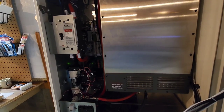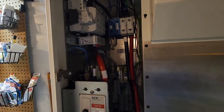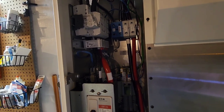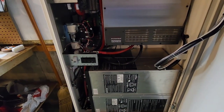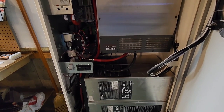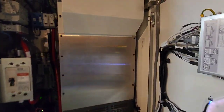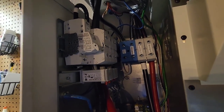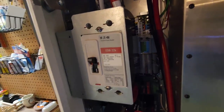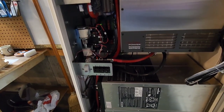One of the glitches is related to the utility program that sends power back to the grid when needed. They work with a company called Virtual Peaker, which sends commands to these batteries. This one keeps sending out a signal to Virtual Peaker, and they respond by putting it into manual mode — in which it no longer charges or discharges from the grid and just slowly discharges down to zero.